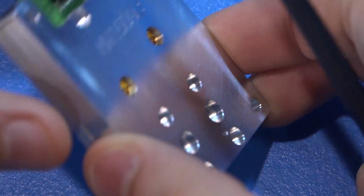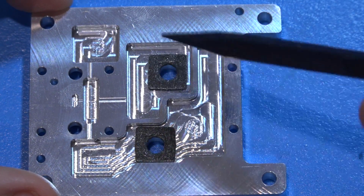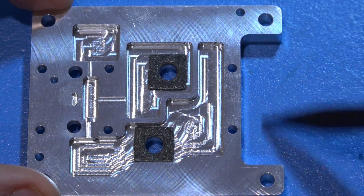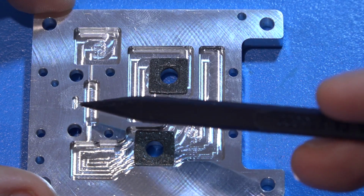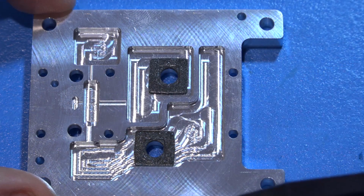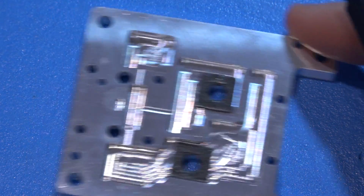So let's go ahead and take it apart and see what we get. There we go. So let's look at this one. Nothing unusual over here. Some gaskets to hug and shield and protect anything from being able to get in and out of the module around the coax. And then this is the empty spot, of course, for the connector. Some cavities being cut out. This over here, this tiny opening, is the back of the waveguide once it's gone through the PCB, and we'll see that there's a nice cutout for that. So there's some really precision engineering going on to machine this because it's WR15, such tiny dimensions.